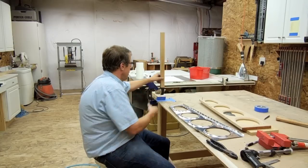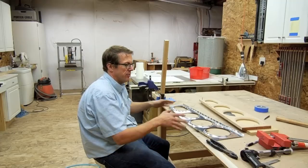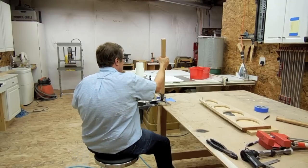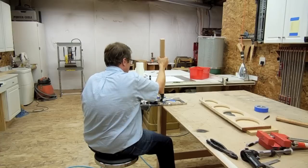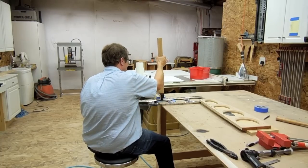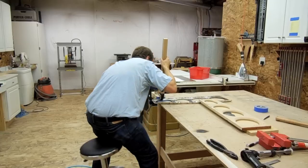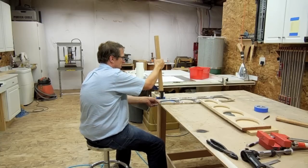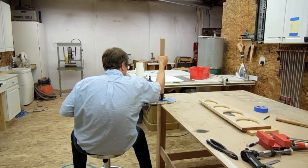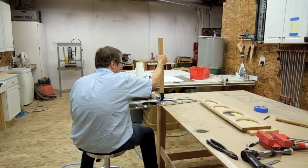And this is cut to 13 degrees, and the bottom of this is cut to 13 degrees, so when I pull it, it's going to overbend it, and the spring back brings it back to almost exactly 90 degrees. For this one, I'm going to need to do it in two passes, but it will get a lot closer. It's a lot easier than banging it, so bring it down. The other side. And on some of these, I'm bending back some of the flutes I did just a little bit. No real way to avoid that.